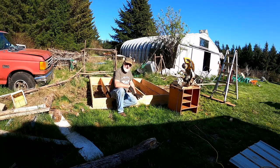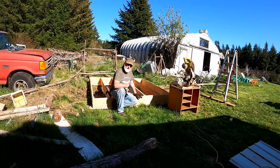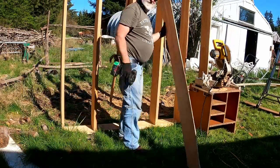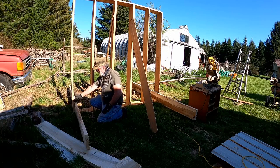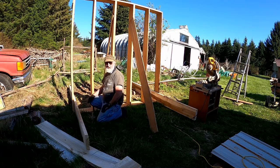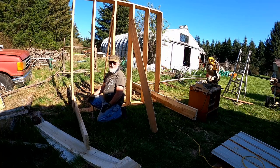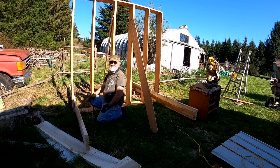All right, this is going to be the working deck, and that's going to be up in the air about six feet. So what I have to do is tip it up on end, build the legs, and then push it over. Sounds easy, right? We'll see how easy that is. We've got it set five feet to the deck. Two feet is where the steps will be, so it'll be a three-foot table. Then I have another three feet out the top for nine feet total. This is the front — the back only needs the legs, it doesn't need the extra extension. So we'll get this screwed on and see about getting that end put together.